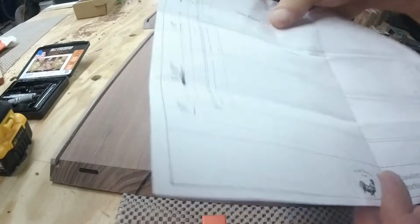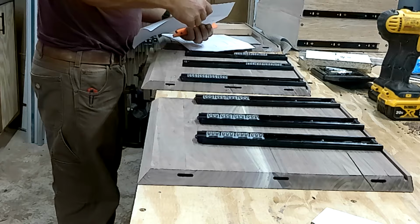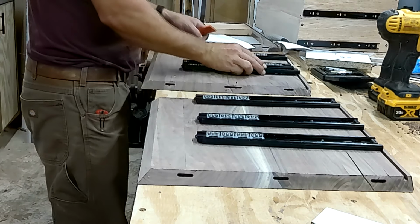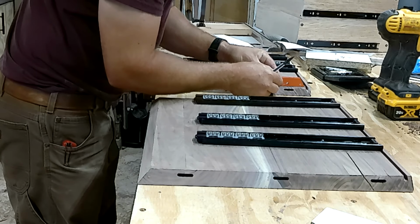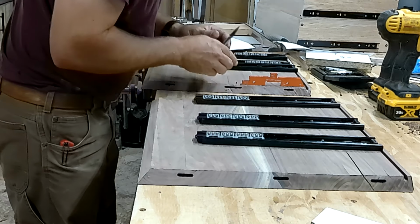Now that all our panels are cut out and ready to go, it's wise to put our drawer slides in first, so I put a special sheet for that to aid in layout. So we're going to set up our drawer slides on our 2 side panels before assembly to make the whole process a lot easier.